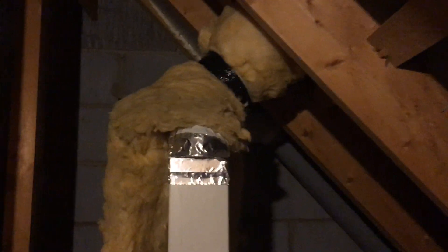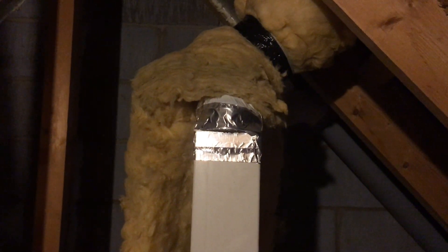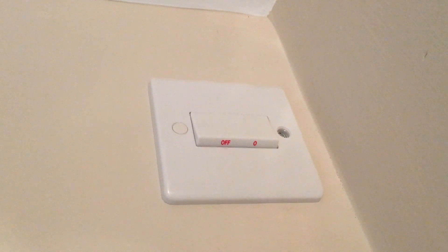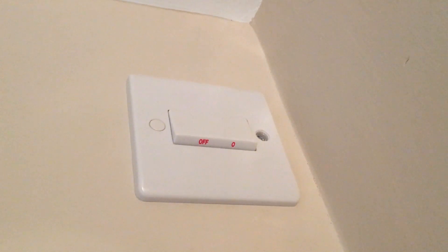What we're going to try to do is use some old-fashioned fiberglass insulation and just bind it around that plastic vent — something I can only do with two hands, so we'll show you the finished result in a minute. All bathroom appliances should have an isolating switch, so make sure that's in the off position before you start undoing things like extractor fans.